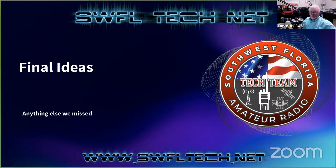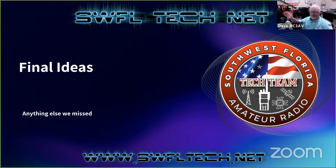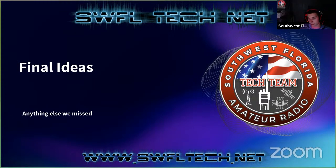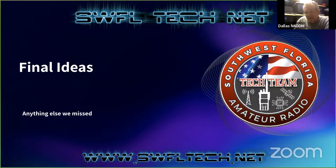Yeah, but that's the problem with the SDR, isn't it? I mean, it's open from DC to light, so you've got gain across the whole frequency spectrum. So if you had some filters in there, you could filter him out, couldn't you? Yeah, as long as he wasn't on that band. If you always had it on 40 or 20, you could put a filter that would only pass that one band, and that would help reduce a lot.